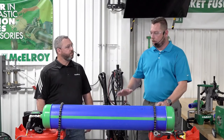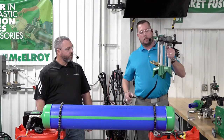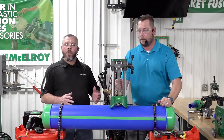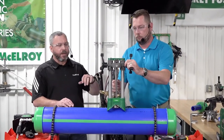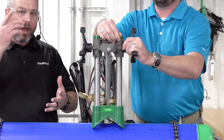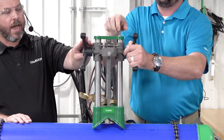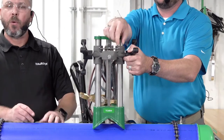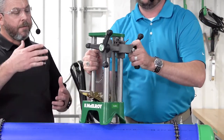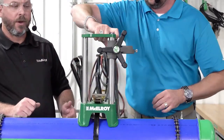We're in the shop at the Tech Center. We've got our pipe set up on pipe stands. Now we need to get the Hornet set up. Starting with some of its components, working from top to bottom: we have a three-position carriage lock — lock up, lock down, or neutral to run freely. We have drive handles on the side. In front is the holder for the drill adapter or fitting adapter with a release pin. The strap goes around the pipe with a ratcheting device to secure it.